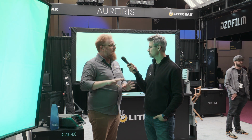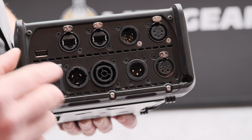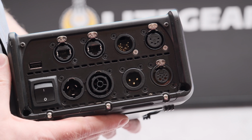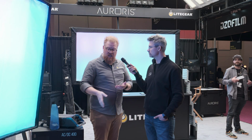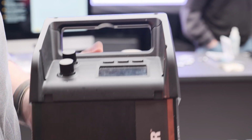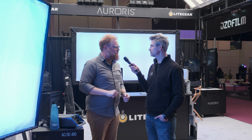They certainly will. And on these new dimmers, you've got RJ45s for ArtNet and streaming ACN. You've got your XLRs for 5-pin DMX. You've got the internal power supply we just described. You get this really cool handle that's got a little notch so that it's perfectly centered when hanging on the knuckle of your C-stand. All those little improvements you get with the new dimmer. You just may not have those electronic improvements.